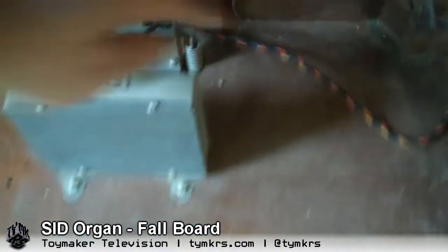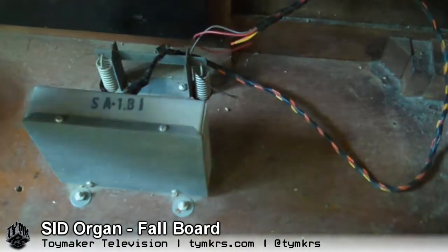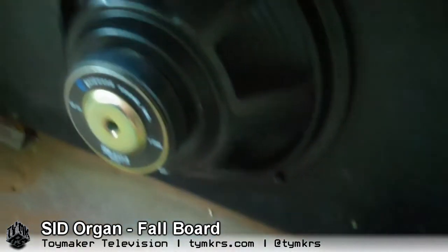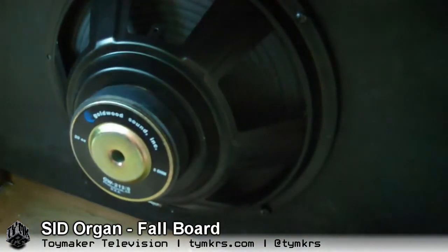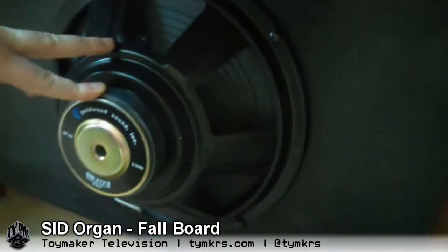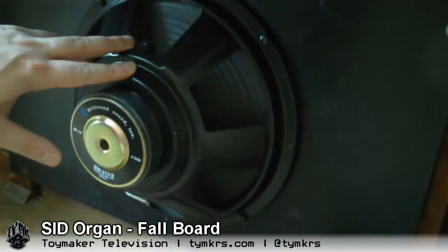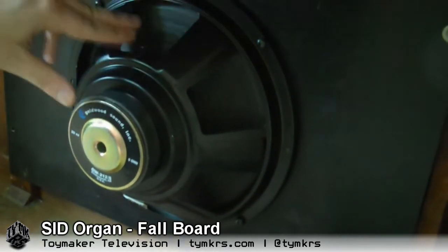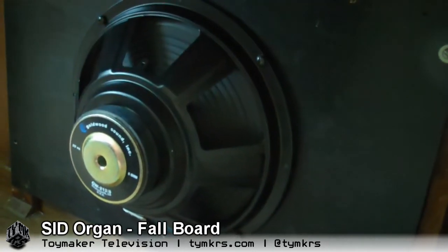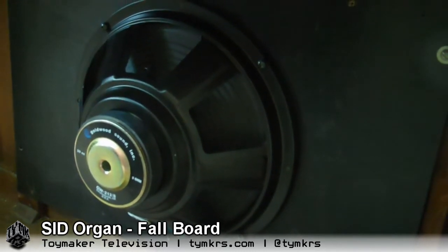There are some wires coming out of here and we need to figure out the pinout on all of these so we can make use of those pedals. We also had a question about the speaker — the guy who actually made Sig Cog was asking us if we were going to add tweeters because this didn't look like a full range speaker. This is a full range speaker — it's a 12-inch full range loudspeaker, not a subwoofer. It's the same kind of speaker that was in this organ before and in our Hammond organs. It can do high frequencies very well and very loudly, it's just not very efficient at it. We're okay with that because we're going to put a big amplifier in here.